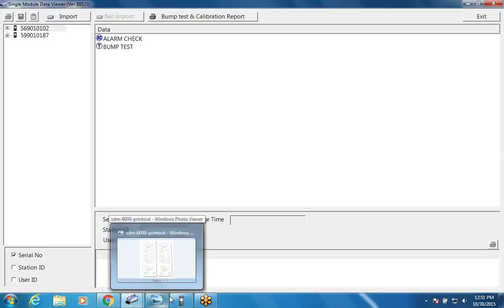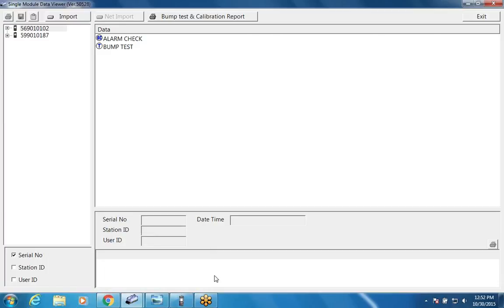So Bruce, now I'm applying the gas. Test, will it calibrate it? Couldn't hear that. If it automatically fails a bump test, will it calibrate it? That's a setting in the bump test parameters. You can either do that or not do that. And you can see on the screen on the right that the readings are changing now because we've got gas flowing to the two instruments.